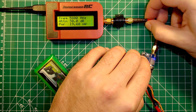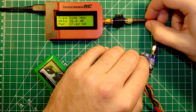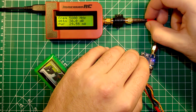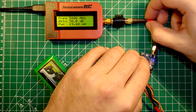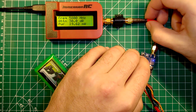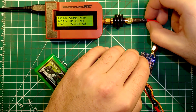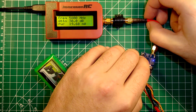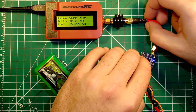Switching to band E: channel 1 is 27 milliwatts, channel 2 is 28, channel 3 is 29, channel 4 is 29, channel 5 is 19 milliwatts. Channel 6 is 19, channel 7 is 19, and channel 8 is also 19 milliwatts. Now switching to band A.